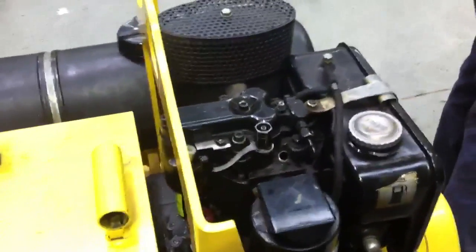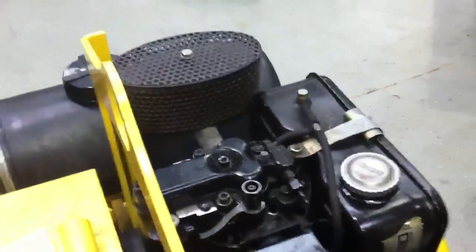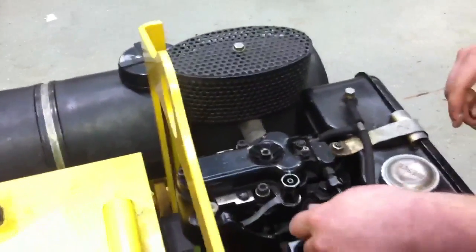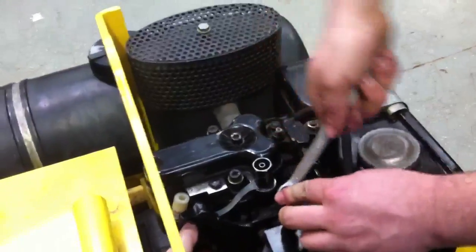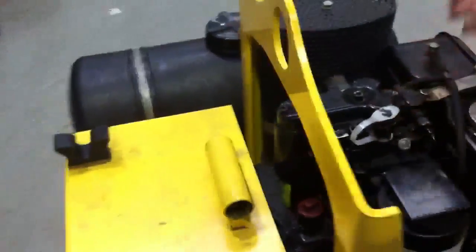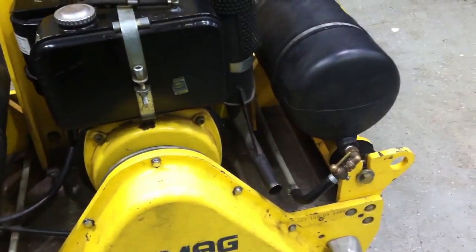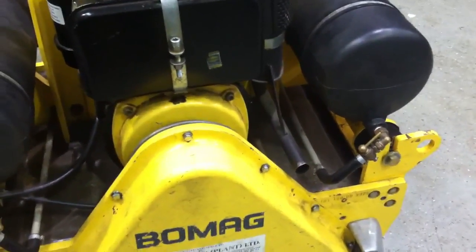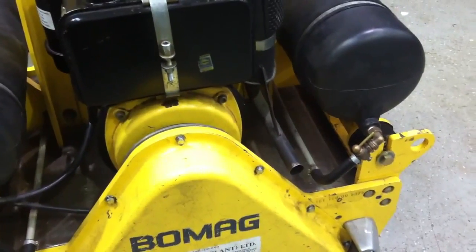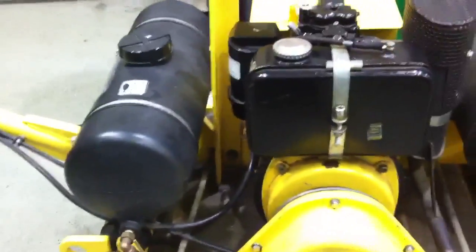We're going to put a fresh cap in, cut off the fuel supply, and turn the engine over on a fresh plug so that any combustion activity we see is purely as a result of the starting cap. With the automatic decompression lever in the correct place, we're going to aggressively turn over the engine and watch the exhaust pipe — any smoke that comes out is purely from the starting cap. It just gives the operator that extra burst of speed when turning over the engine, meaning the hot compressed air has less time to escape into the cooling jacket, giving a better chance of firing the engine.